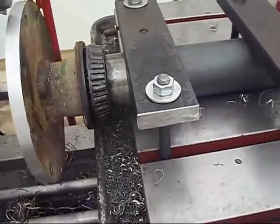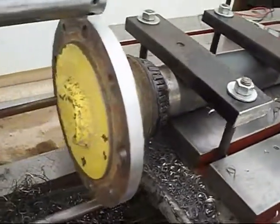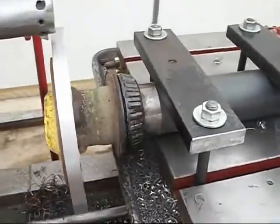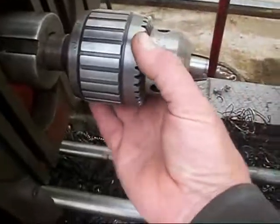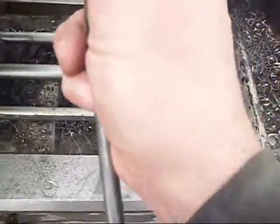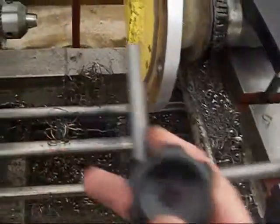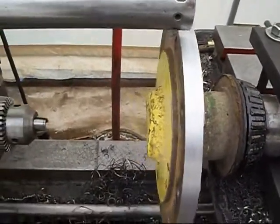I got my part lined up in here, got it clamped down good. Got it dialed in — I've been doing some cutting on it. To dial it in, I put the chuck into the spindle here, and then I put this into the chuck. That part went into the chuck and it had the dial indicator there, and I swept that around the outside of that wheel — hub, whatever you want to call it. And that's how I dialed it in perfectly.